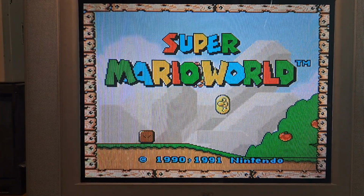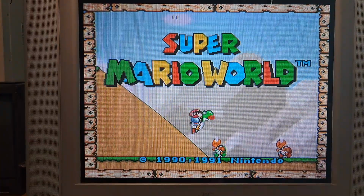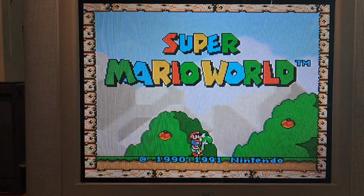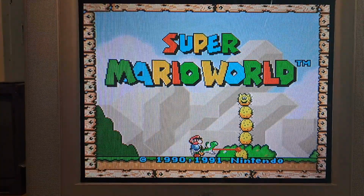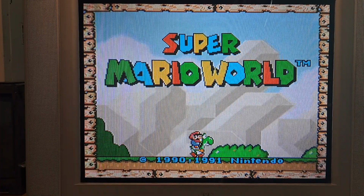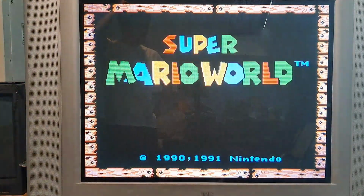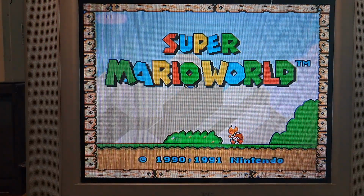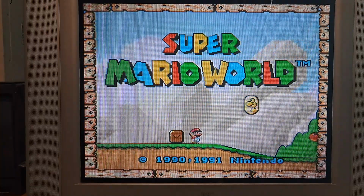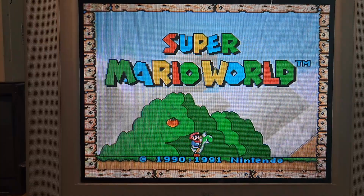So, anyways, because everything looks pretty good so far, that's pretty much it for this video. I know it's a bit of a long video, but I hope some people were entertained or at least more informed now about, in general, adjusting purity, adjusting convergence just a little bit. As I said before, typically speaking, you don't want to touch the purity rings, but because this is a very large set and they have purity issues for the most part, your mileage may vary.